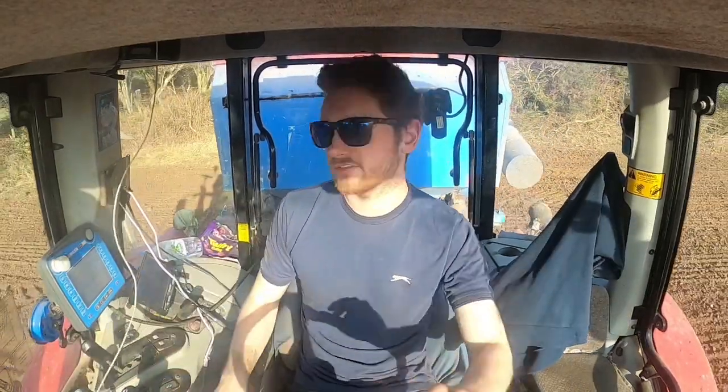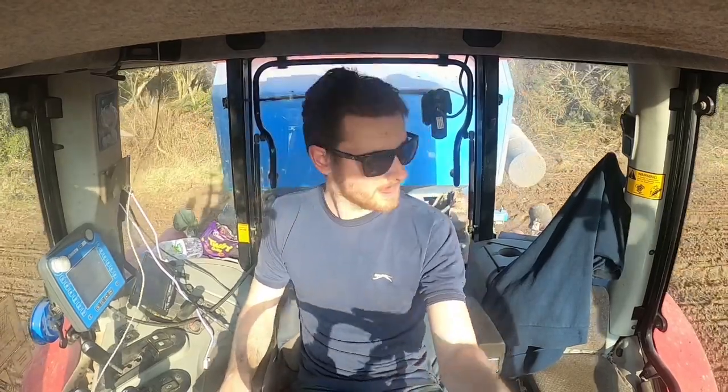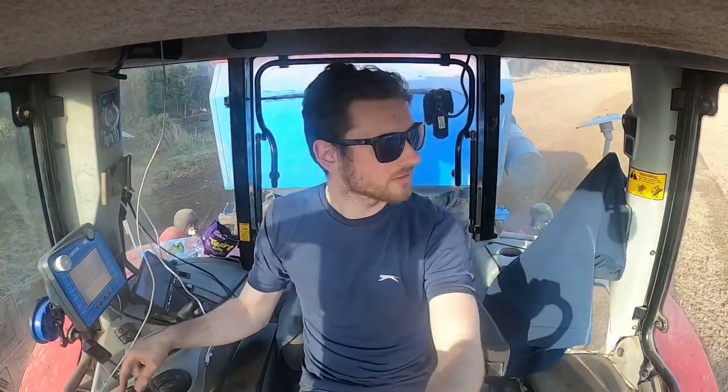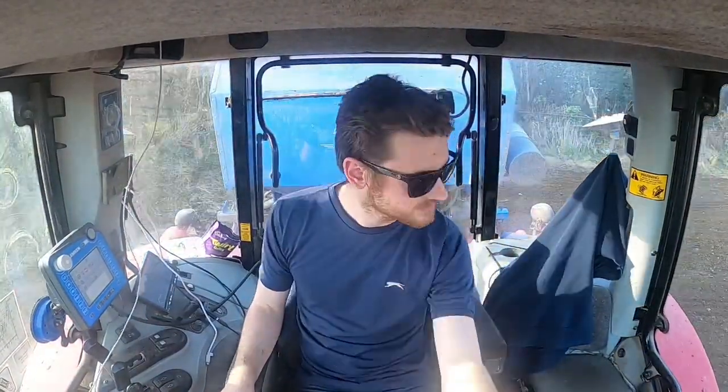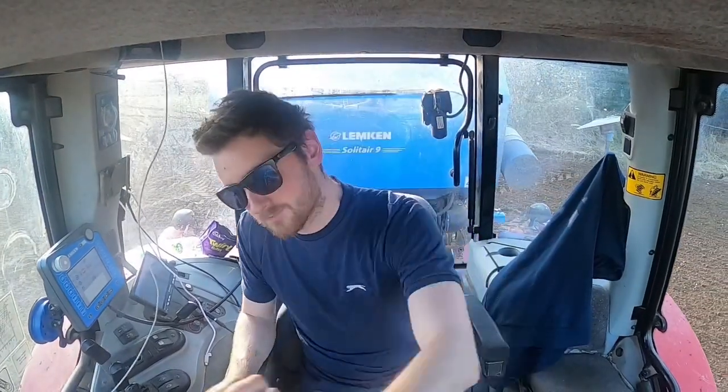Just see in the corner of your screen where the straw is coming up and down. When we're ploughing, especially in the spring, we plough the nose of our tractor out to the hedge, so then our headlands are shorter, because we're on 24-metre booms. We're able to keep the inside furrow, which I tilled up, within 12 metres, within 11 metres. So the sprayer isn't driving across it every time it goes up and down the field. And we reckon this does a lot for saving the sprayer, instead of having it bounce about the whole time.